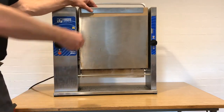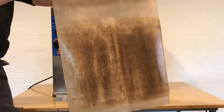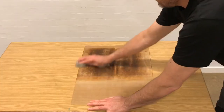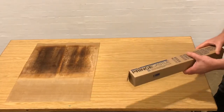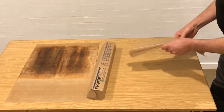Remove the clamp bar and the release sheet. Inspect the release sheet. Wipe and clean the release sheet. Sheets should be replaced every three months, or sooner if damaged. Pictured on the left is a damaged release sheet.